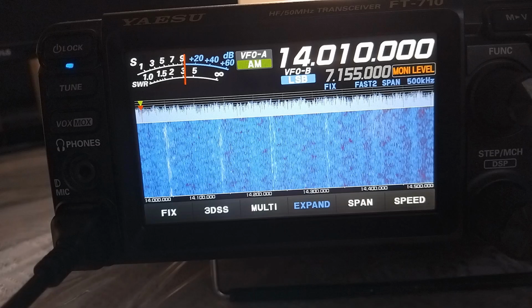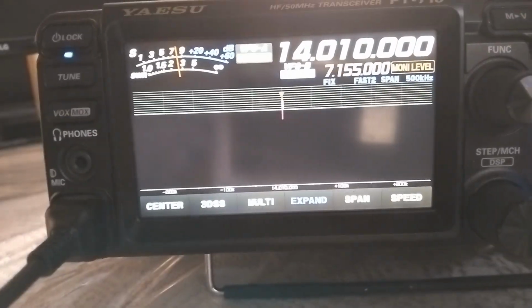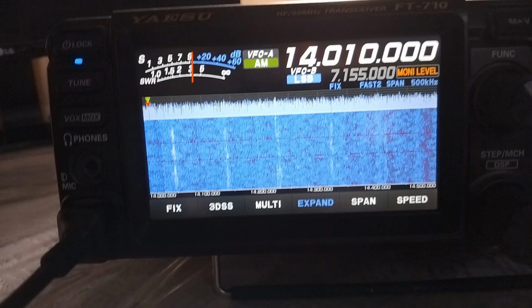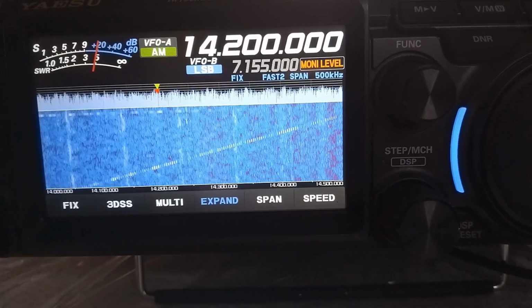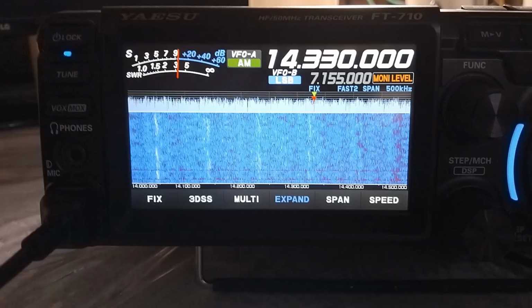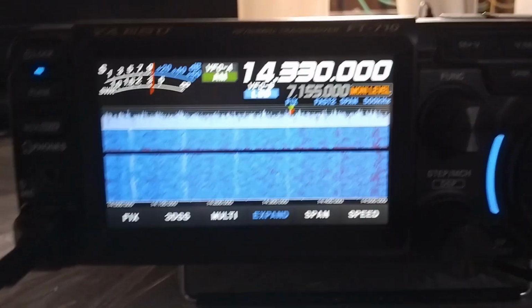Mounted the loaded coil 80 meter antenna back again and started checking the SWR on 20 meter. Checked at the lower end of the band and I was happy to find that it had come down from the previous 5 to around 4, this time on 14.010 MHz. It was slightly higher at 14.100 MHz. Almost same pattern was noted at 14.200 MHz. SWR was nearly 5 at 14.300 MHz near the upper end of 20 meter amateur radio band.